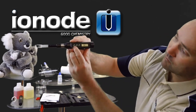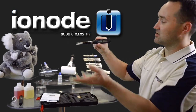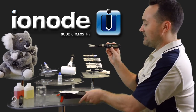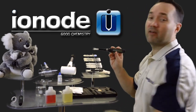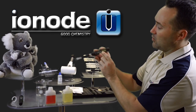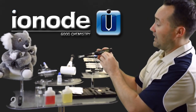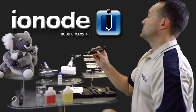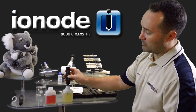At this point, go ahead and turn it on. There's an on button right here. Once you turn it on, it'll cycle through and then pop up and show your pH units. Right now it's not measuring anything, so it's just going to fluctuate around at random. This unit is really nice in that it has an auto calibrator. What I've got today is pH 4 and pH 7 buffers. All you have to do is press and hold the Cal button when you go into solution. I did it and it came up with ERR — an error — because I'm not in solution right now.